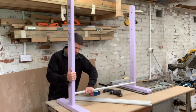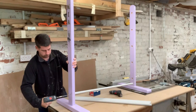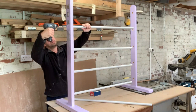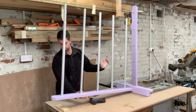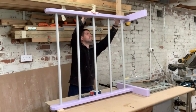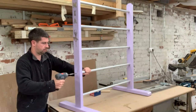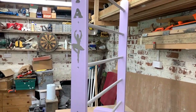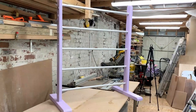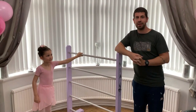The last thing to do is just screw it all together. As I said before I've designed it so it can come apart, so I'm using two and a quarter inch number eight wood screws. I've already pre-drilled the ends when I put the screws in to straddle them across the sawhorses for painting, so I can just put them straight in now — nice snug fit. What do you think? Fantastic! Thanks for watching — if you enjoyed the video hit the like button and don't forget to subscribe. See you next time.